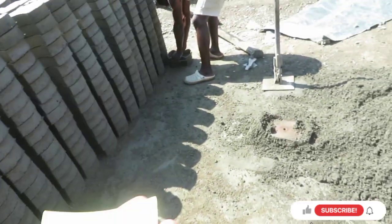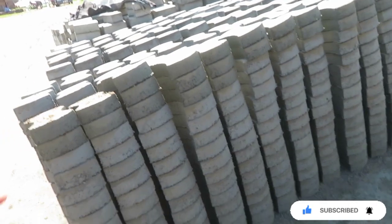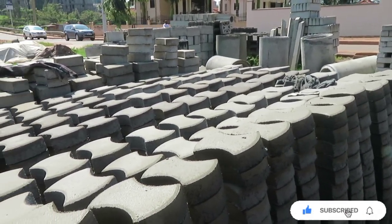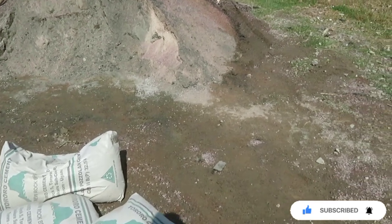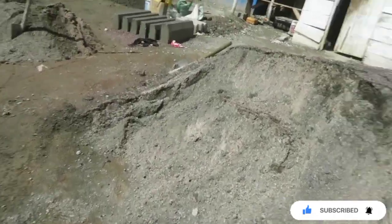So for starters, the mixing — these people's mixing is a little bit different because it's actually stronger. Back in the day, we used to mix two wheelbarrows of cement to four wheelbarrows of stone dust. But these days for extra strength, people are putting dominantly stone dust. They're using four wheelbarrows in total — three and a half wheelbarrows of stone dust. For those that don't know stone dust, this is how stone dust looks like. They're using a small grain, which is the black stone dust — it's actually very good. There are different grades of stone dust.